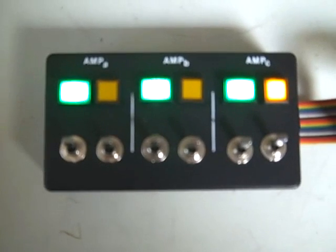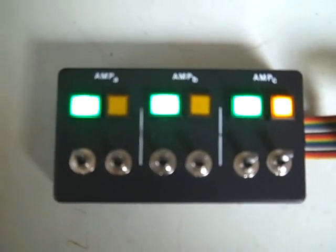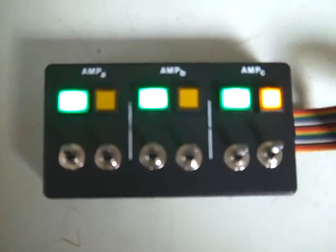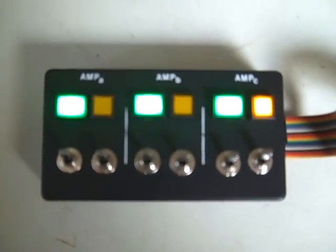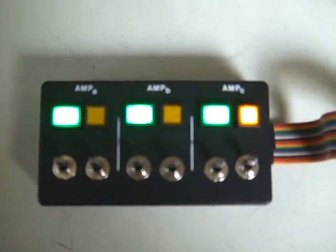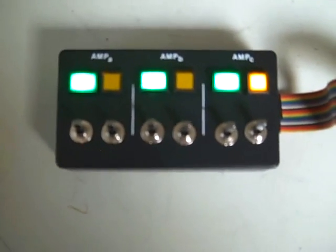There are some other provisions in the circuitry which I'm not going to be able to demonstrate. There's also a protection fail-safe circuit which monitors the state of all the logic circuits, and if there's any kind of logic glitch or unexpected behavior, it simply shuts down the power supply. Because when you're sending 4,000 volts around your station, you want to make sure that it only goes where it's intended to go. That completes the demonstration — thank you for watching.